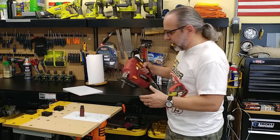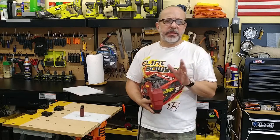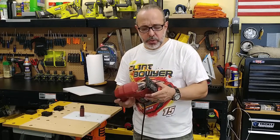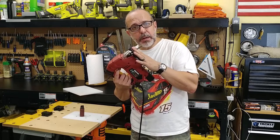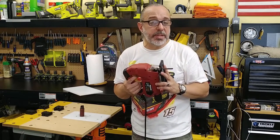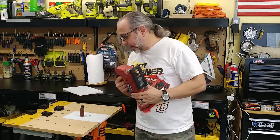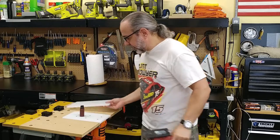What I've decided to do — one of the biggest issues about a jigsaw is how much play the blade has. I've had in the past what is called a zero-gap blade plate on a faceplate, and that improves the functionality of the jigsaw quite a bit. I'm going to take that to another level by not only adding a larger faceplate, but incorporating it into the HarborFreight workbench.